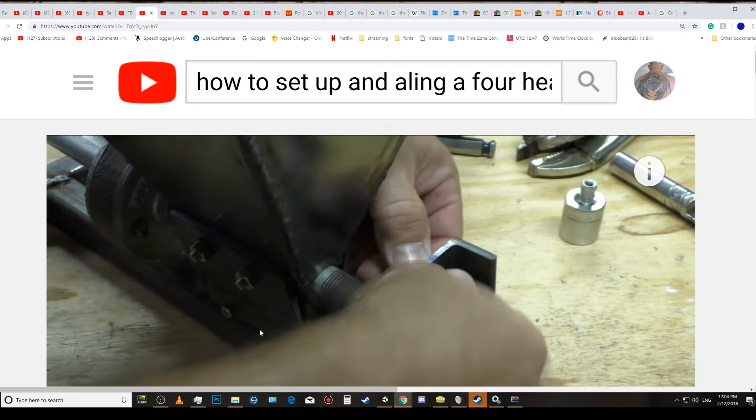Your equipment design is almost there — you're just using the wrong components. You've got the wrong drill bit, your heat sensor is in the wrong spot. Move your heat sensor back a bit and manipulate it until you start getting a firmer filament at the end. Remember, you're not 3D printing downwards — you're pushing plastic out. You want the right temperature as it comes out, and you want your die hole slightly bigger rather than smaller for a consistent gauge.